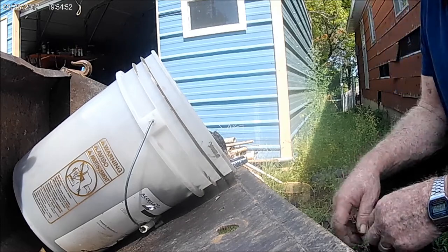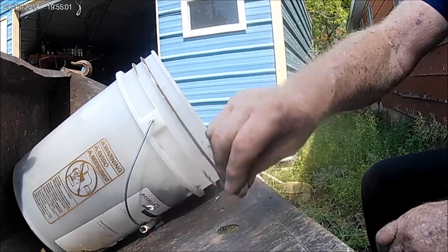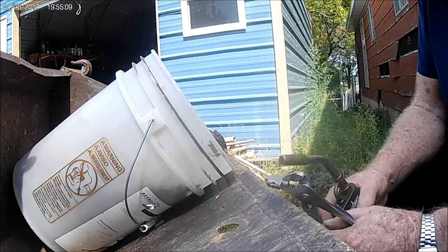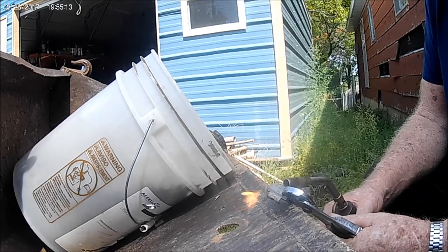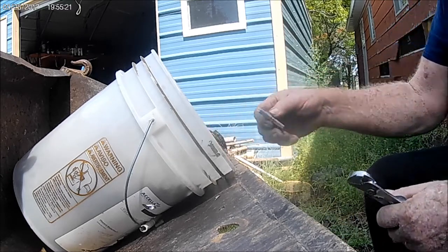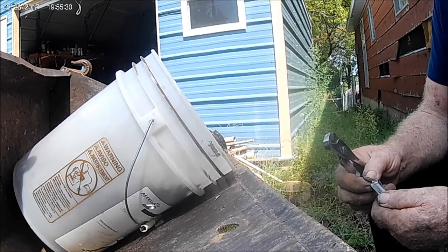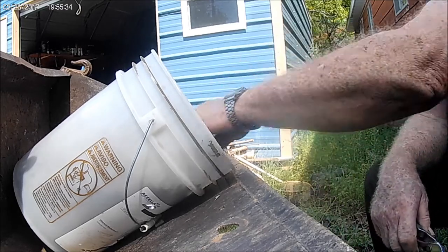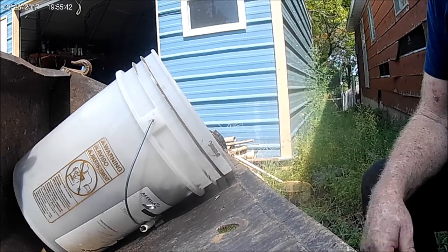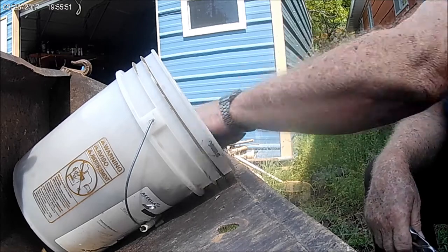What I do is, for one thing, you can scratch it — if it doesn't sound like metal, it'll be lead. And if there's any doubt, I just take and put it up here, grab my trusty old torch, and see if it melts. That's not melting, so that is not lead after all. Sometimes you can just take your pair of pliers and pinch on it. That one seems to be lead underneath that coating. These little flat ones here are lead — you can pinch a little corner off, and you couldn't do that with metal.